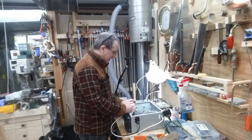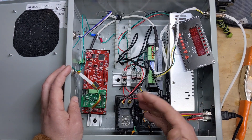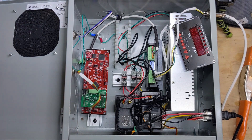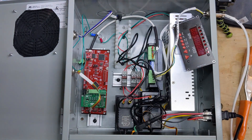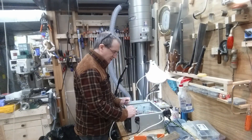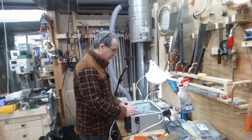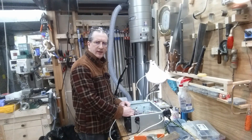The other possibility is my cabling. I had to do a lot of cabling — making up connectors — and I'm pretty happy with it in the sense that I've never done it before. It makes it a lot neater to have the external panel connectors on the board so I can just plug things in with these aviation-style plug connectors, running from the control panel to the motors or whatever. But it's possible I've got a short there. I don't think that's the case — I did make up a little test cable and connected the board directly to the control panel and got nothing, so I suspect it's something in the electronics. I'm sure that'll be one of our upcoming videos where we can talk about what I found and how I get around it.